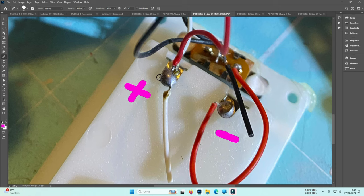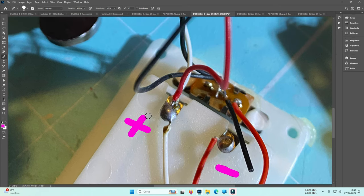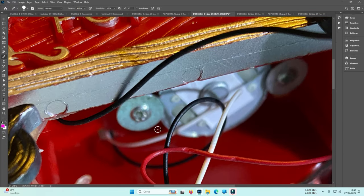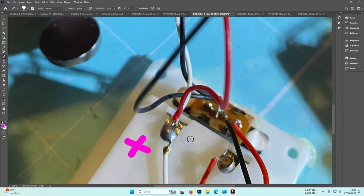In this case, the flexibility is, I've identified that here there are 2 wires connected to the positive from the battery, then the same 2 wires need to be connected to the positive of the AC adapter. Nothing more, nothing less. Reverse engineering, but it's simply an analysis.